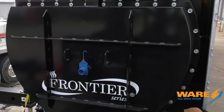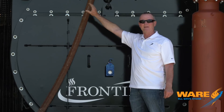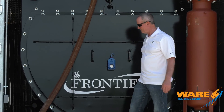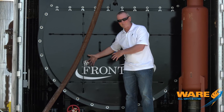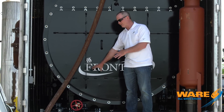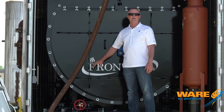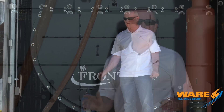The rear door — this is a two-pass boiler with a single rear door, a real heavy-duty hinge with heavy-duty bearings on it. Victory designed it for us — easy to swing, this door swings out very easily. On the bottom blow-downs, we've pulled those valves back to be accessible from the rear of the boiler. Normally they're up under the side where you don't want to be climbing under there to get to them. We want them back here on the rear so you can open and close them standing up. Everything in this unit is designed for easy access, easy maintenance, and long-term longevity.